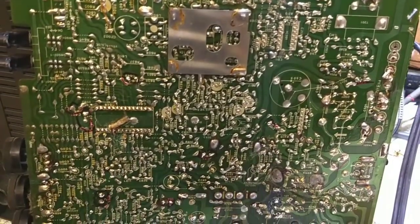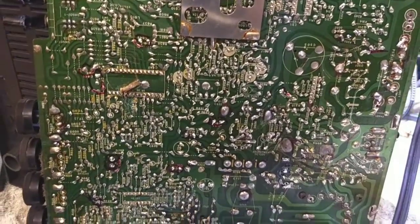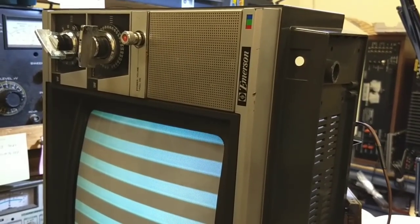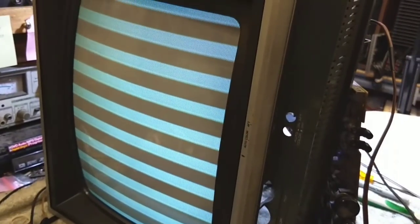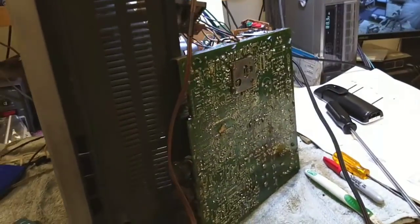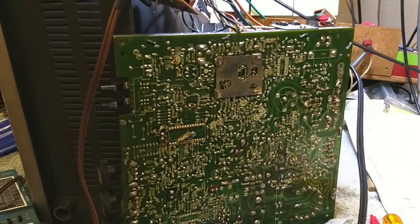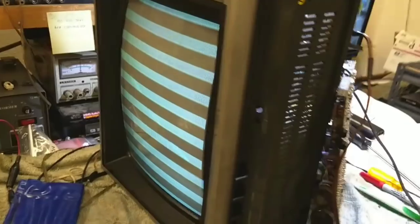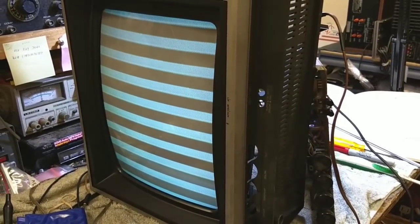Sync pulses look good, but there's no 3.58 MHz oscillator, so I'm kind of wondering if replacing the crystal will fix that — but then there's the other issues at hand. Rapping on the board changes nothing — I don't get any flickering on the screen, so that kind of precludes poor connections. I was over my work and also checked all the remaining capacitors in the IF and video amplifier circuit; I removed them from the circuit and they all test okay. There's not any that are leaky, shorted, or have bad ESR. There's just something horribly wrong with this thing and I can't figure it out right now.